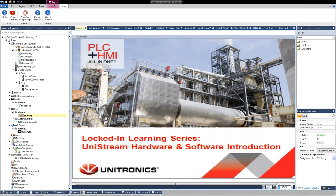Do we have any technology to control CNC? CNC is not currently a targeted application type for us. We could certainly send values to a CNC, recipes, and we do motion control. We have axis control, but we're not targeting the precision that's often required and the synchronization of multiple axes, like the four or five axes of a CNC machine. No current interpolation between the axes.